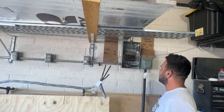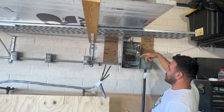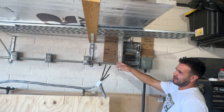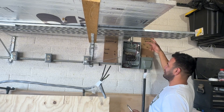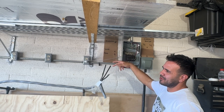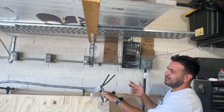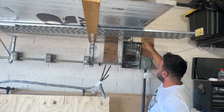That would actually work — that would be your transfer switch. A lot of people do that with an interlock switch. You could use that as your 100-amp bypass, or it could act as a bypass if your inverter fails. You'd use an interlock device just so you don't backfeed when you get your solar back. That's actually a good way to go about it, and if my inverter fails, that's exactly what I'm going to do.